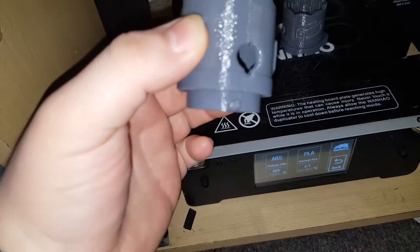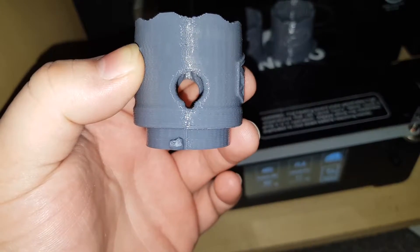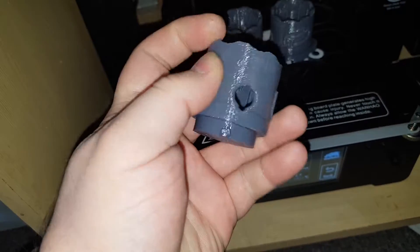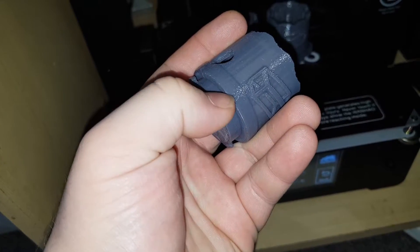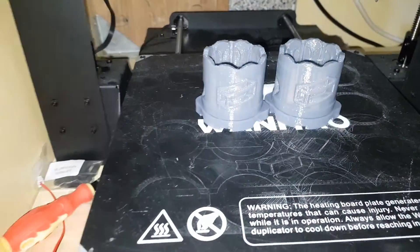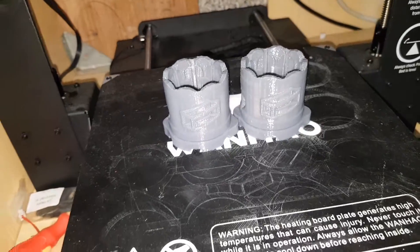As you can see there, it is an overhang right there. So when it comes to printing this plastic, you'll have done this base here. When it gets to this point, this plastic around the outer edge here will just drop down unless there's something there to stop it. So sacrificial material is there to be pulled away.